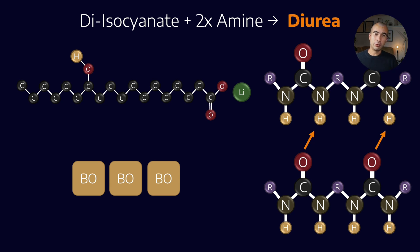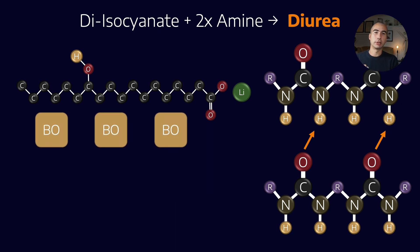Going even further, the way polyurea greases interact with base oils is very different as well. With lithium or other metal soaps, that long hydrocarbon tail is what binds itself to the base oil, and when put under stress that bond is weak enough that it can release the base oil to do its work. With polyurea greases we don't have that — the molecule is highly charged, and there's no way for the base oil to really connect to a polyurea molecule. That's particularly a problem when formulating with Group 3 or PAO base oils, which are highly nonpolar. Often we'll have to introduce a co-base like an alkylated naphthalene, an ester, or a naphthenic base oil to help bind the base oil with the polyurea grease.